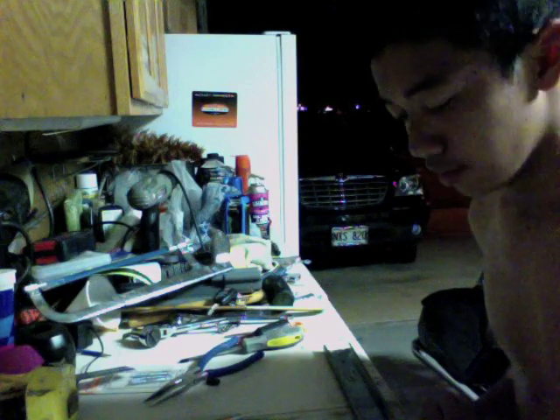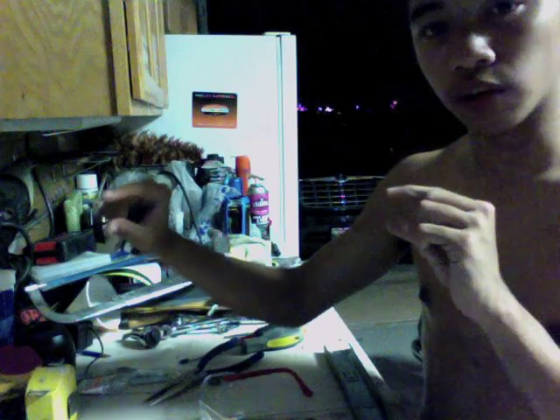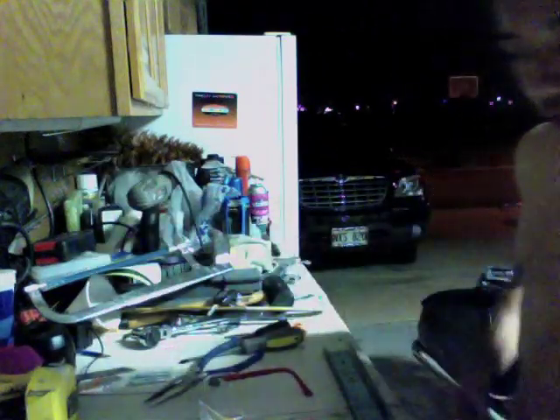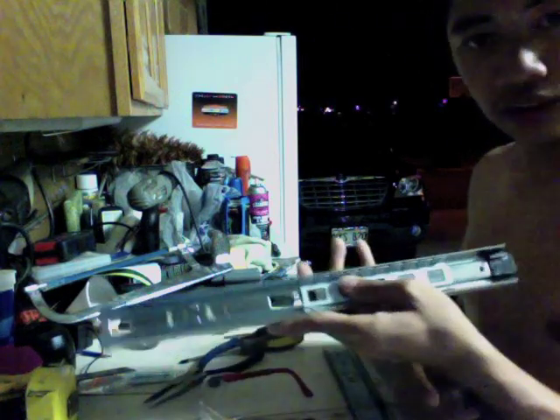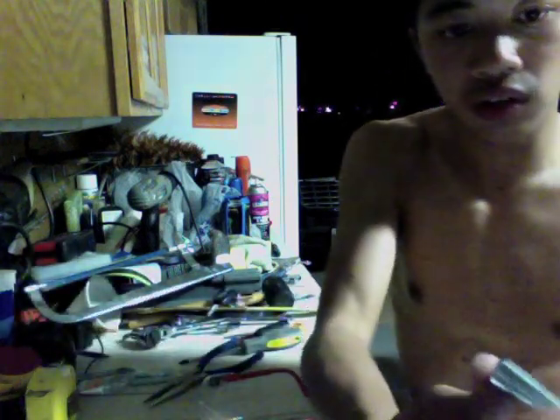For the first step, what you're going to do is cut the drawer slide apart. But in doing that, you will first need to take it apart. The most inner slide has a black knob. When you pull it all the way out, you'll be able to pull on the knob with your finger and pull the first slide all the way out. I've already taken it apart. The second slide should end up looking like this, and the base slide should look like this.